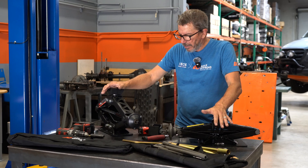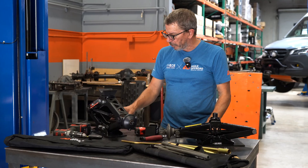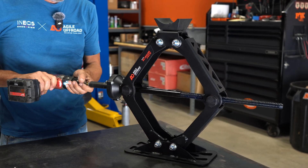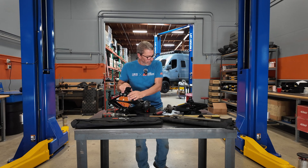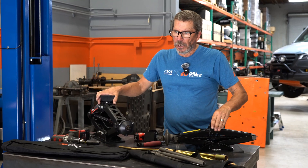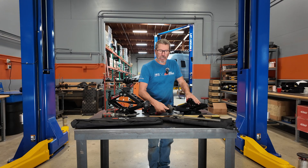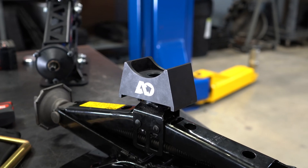Both these jacks do the job, but this one's just a lot more purpose-built. A lot more superior hardware — hardware is much bigger, the bolts in here are bigger, the spread of it's bigger, the plate material is thicker. Everything on this really screams heavy duty and purpose-built. This we repurposed — this is a factory H1 Hummer Jack. We don't do anything to these; we didn't design anything on this. This is designed for picking up an H1. The only part that we did is we made this little adapter in there, and that's it.